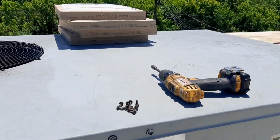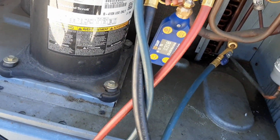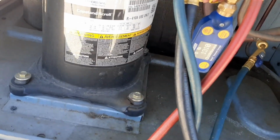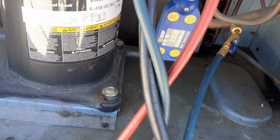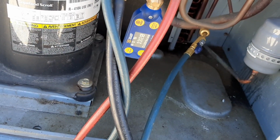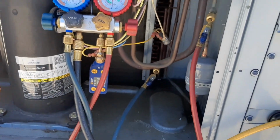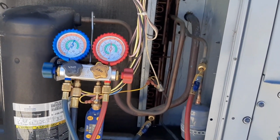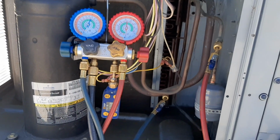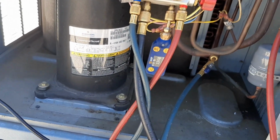So we're back. I got some filters. We were about 1,200 microns. I did talk to the guy, and just shaking the compressor up a little bit, it raised up. This was refrigerant on this. He did not put nitrogen on it, so that pressure I had was still refrigerant, so I'm just pulling out of the oil right now, and I'm happy with where we're at.